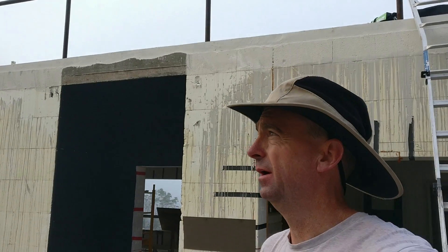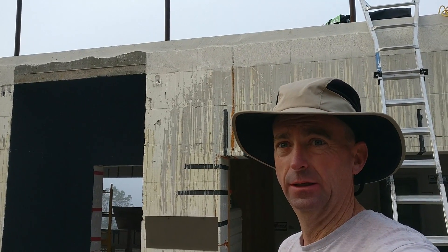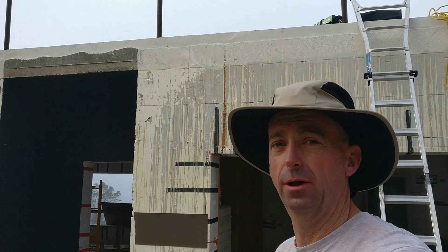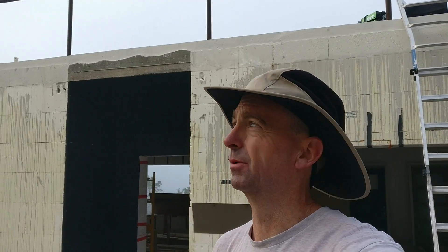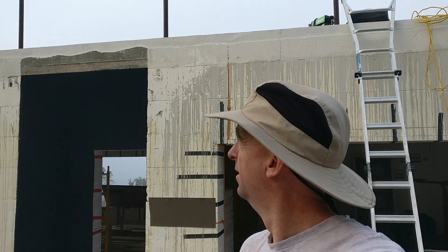Let's go upstairs, but I have to wait a little bit first. I'm going to do some cutting down here, but the pipe is still wet. You can see we have a heavy, heavy fog — we've hit the dew point. I really don't want to cut, grind, or weld on anything that's wet, so we're going to let the sun get over the top here and burn off the dew. But right now let's go upstairs and I'll show you what we've done.